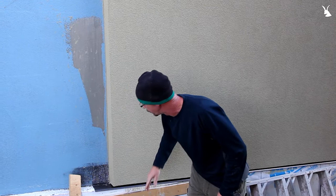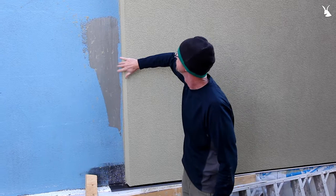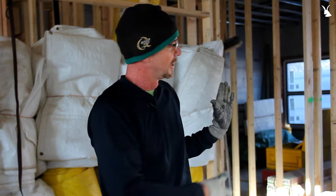Another way of looking at stucco is in critical light. If you have a wall facing north-south, you want the sun at around noon so it's shining parallel to the wall — that way you can pick up every imperfection, whether it's waves or holes, because the shadows will reveal it.